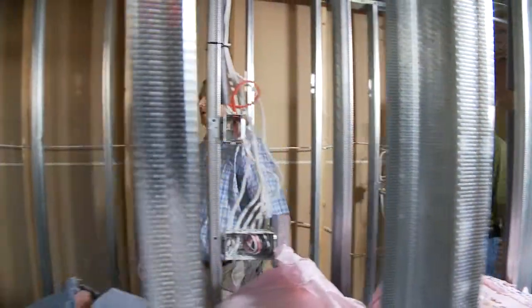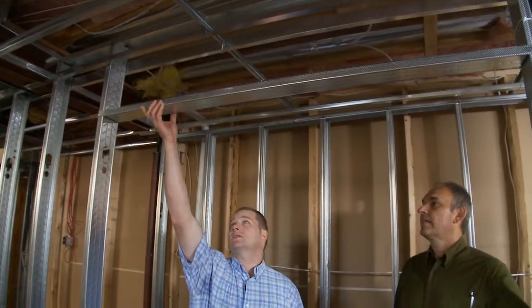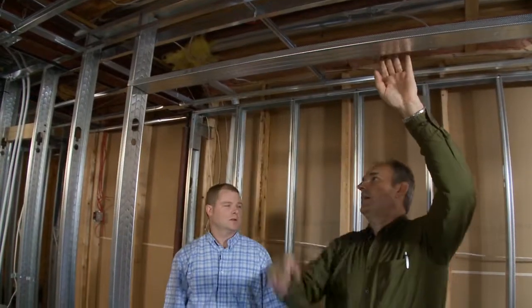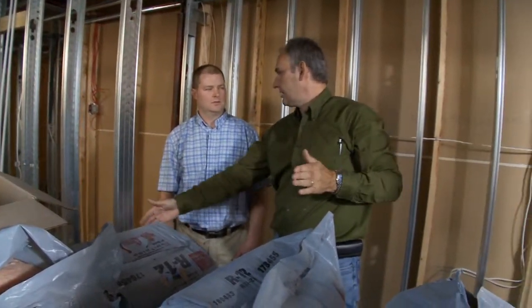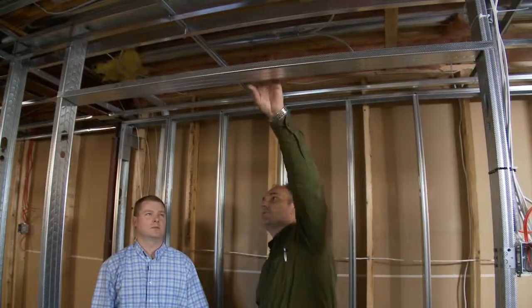This here is actually where we plan to put a pocket door. I noticed that it's not very strong — they're missing all the cripple studs that go up here to divide it and give it strength. For a pocket door frame it's really important to have this surface 100% level, or the pocket door will not fasten properly and close level on the side jamb. You'll get a crack — it'll be hitting the bottom or the top gets moved away. So this has to be very strong and very level, and we'll make sure that's done.